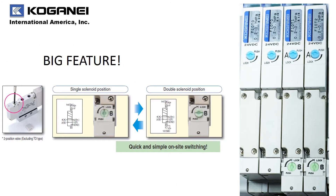Now for our biggest feature within the F-Series. With the F-Series 2-position valves, you can use a manual override to select either a single solenoid valve or a double solenoid valve function within the same body. You accomplish this by doing a simple half a turn on the B-side coil manual override.